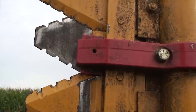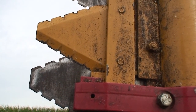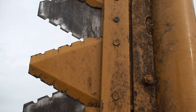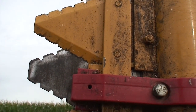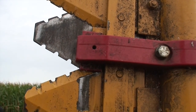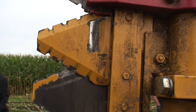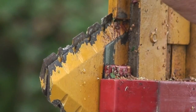The individual blades are bolted on from the back side — each one is just a fine-thread bolt holding it on. You take your clamps off, the bolts that hook it to the push arm, and they open up with a Torx bit. Depending on the material, I've run these on some pretty rough material and break them a little bit. They're a through-hardened blade; we make them ourselves. You can sharpen them, put more aggressive edges on them, and they actually start to cut better once they get worn in.